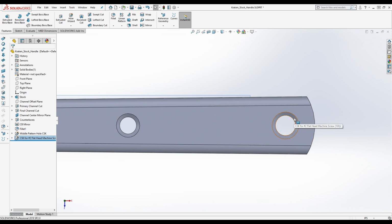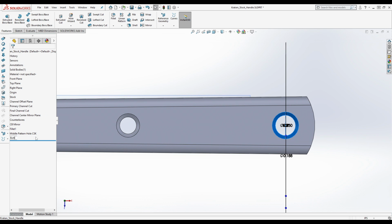Does that make sense? So for whatever reason, this handle right here is actually probably a very rare handle, if I had to guess, because it appears that he drilled this, and after drilling this handle and getting it cut out and stuff, he changed his CAM, his tool paths, to essentially account for a larger hole there, which is why this appears to be a different size chamfer, right? Because it's got a 1/4 inch countersink here because he changed the model, okay? But basically, he drilled this handle before changing the model and milled it after changing the model. So I don't know how many handles there are like this in existence, but it could be quite a rare handle, okay? And it would make sense because the other handle is properly sized, right? So does that make sense, guys? Yes.